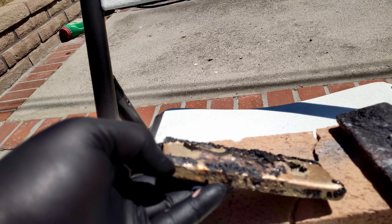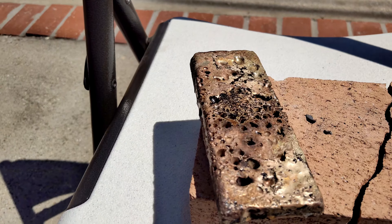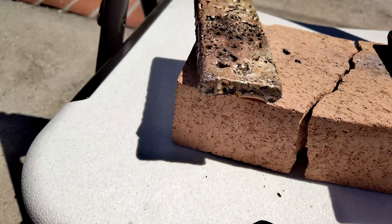I tried skimming some of the crud off with a small spoon and it wasn't sticking. I had an idea — ask for verification on this, leave your comments below — I should, once I've got a molten alloy in the crucible, hit it with a couple of spoonfuls of borax, let it clump with the impurities and the crud, then use a graphite or stainless steel rod and hopefully it would stick to that and I could pull it out that way.